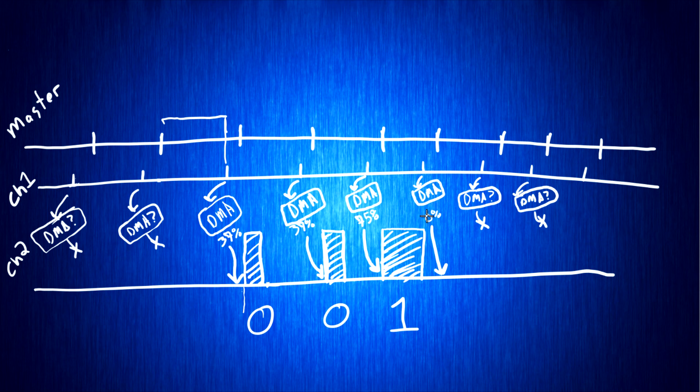The final DMA event triggers and we have 0% loaded — no high value at all. It returns down to low, the DMA is now disabled, and it continues to leave the channel set low, so we're not getting any pulses out at all. This shows pulsing out a 0, 0, 1 in the DSHOT protocol.